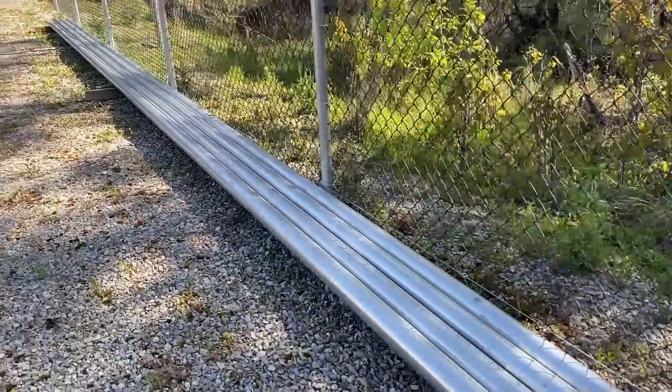The top-loading wires are attached to a couple of eye-bolts with thimbles and a solder lug for electrical redundancy. To prevent the vertical from sounding like a train whistle in the wind, I added a polyethylene test cap that's usually available at most home building stores. I give it a shot of plastic-ready paint to minimize UV deterioration.